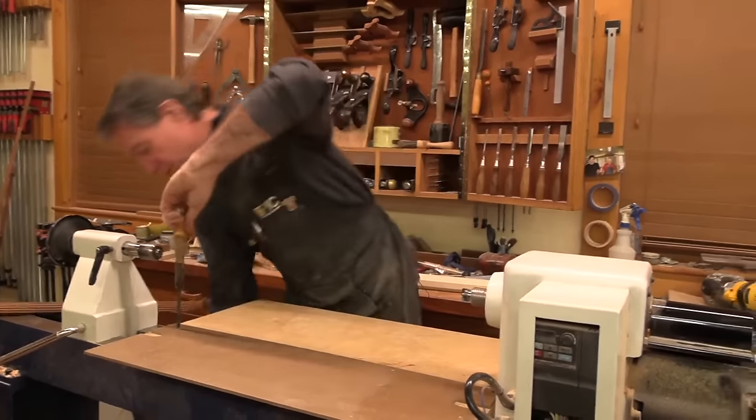So that was poplar. I wouldn't use poplar, but I like something harder without a lot of pores. You want a close grain wood. So something like maple, hard maple is great because it has good weight to it. Walnut's a porous wood slightly. So I would stick with the hard maple. You could use cherry, it's a little softer, but birch would be awesome too. So there's a lot of woods out there. Close grain, harder, makes the best.